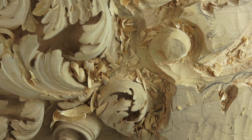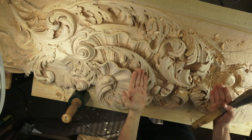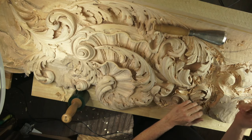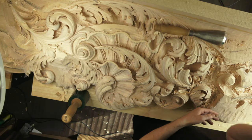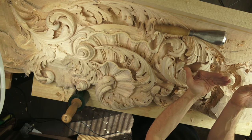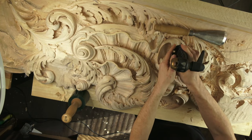About how I hold the relief: this is a big one going all the way to the ceiling, so I can't use standard carving systems. I'll create support on my knees at 45 degrees later. For workbench height, in woodcarving your bench should be at elbow height - in my case right there - so your back doesn't hurt and you can work easily.